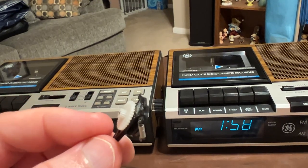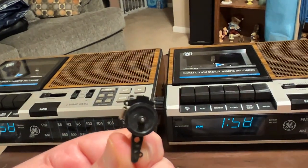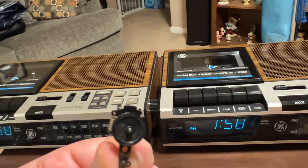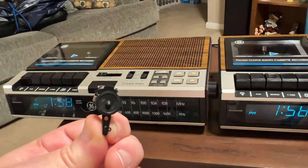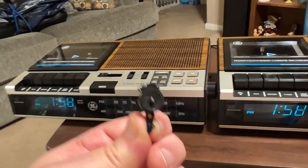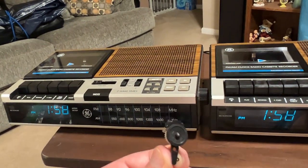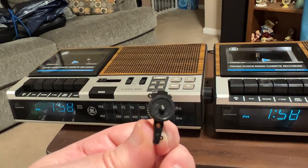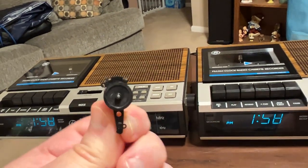But what really gets me is the idler I replaced it with from another Tanashin mechanism actually had a clutch on the other side for rewind and fast forward. So when it hits the end of the tape, it won't hurt anything. It'll just sit there and the motor and belts will keep spinning. If this one hit the end of the tape, it would sit there, and if you hear that squealing sound, that's your belt. Your belt is actually squealing. So what if you hit rewind, but you walked out of the room to say use the bathroom and come back? This thing here will be chewing up your belt, squealing, whereas if I had the clutch in it, it won't hurt a thing. The clutch is just like a felt pad against nylon. It never wears out. But yeah, that's one sign of cheapness.